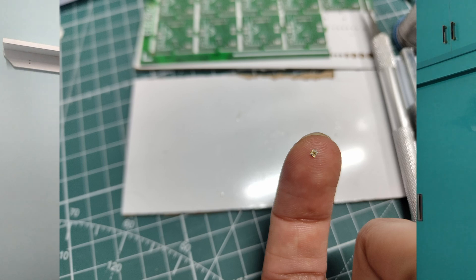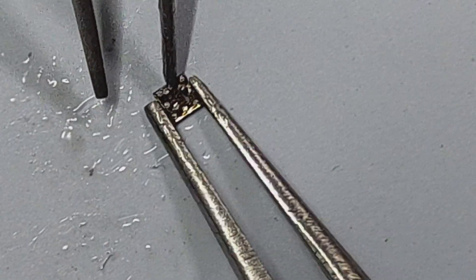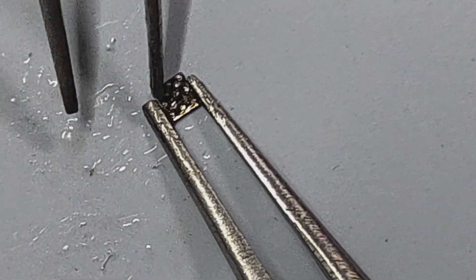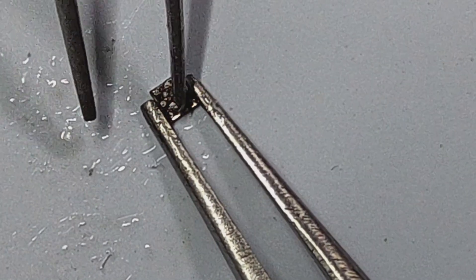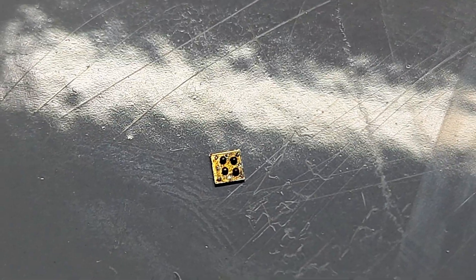The IMU board — you might have seen the whole rework video. I tested all components and everything looked good, so I got a new PCB done after the necessary design changes: updated all traces and fixed minor issues. I opted to do manual soldering by swapping components from the old board to the new board. The biggest problem was the BMM150, which is again a tiny BGA component — one tenth the size of the flash chip. Whenever I tried to do reballing, the component would just fly away or the solder ball would blow off even at the minimum air blow level.